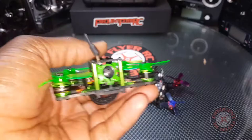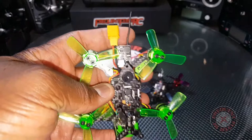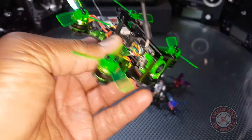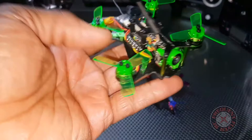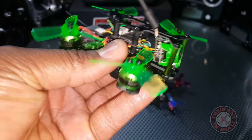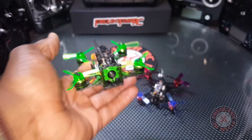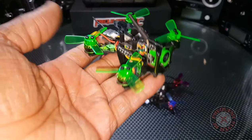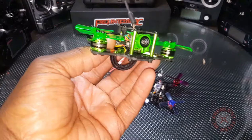You can change your PIDs right out on the field with the transmitter. This is the FrSky version. One thing I don't like about the FrSky version — FrSky receivers in general — is you can't fly it too close to yourself. The transmitter will say 'RF signal critical, telemetry lost,' and sometimes it'll even fall on you. I heard someone say they lost signal in the air away from themselves, but that has never happened to me.